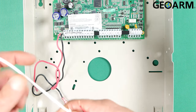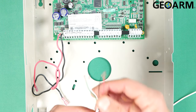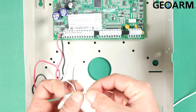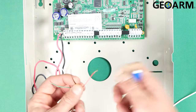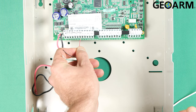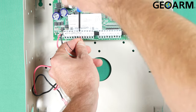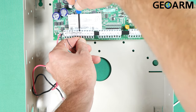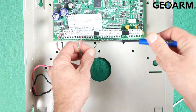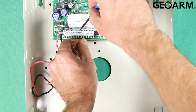You're going to go ahead and get this wired into the panel itself. Our panel is powered down at this moment, so we're going to go ahead and get this wired into the keypad bus just like a keypad would. Red wire, you're going to wire into RED. There's going to be wires in there already — that's fine. Make sure that you put this in there with them and just tighten it up. Then you're going to go black wire to BLK. Once you get that in there, tighten that up as well.